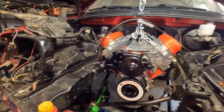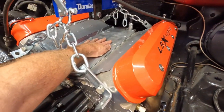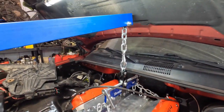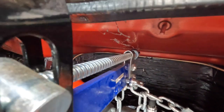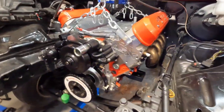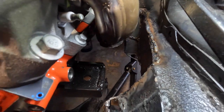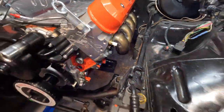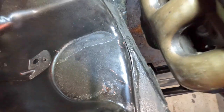We've made some progress. Here's the motor sitting in there — it's just floating for now. Got to get a different way to suspend the motor. I do have a plate; I was just up at work to grab it but grabbed everything else but that. We need a little more clearance with the cherry picker — it's about to hit the hood. Unfortunately, with the engine leveler there, I scratched the crap out of the upper part of the cowl, so I'm not very pleased with that. But here's the biggest thing: we have boatloads of clearance for these manifolds. The lower flange portions are not welded onto the manifolds yet, so we've got to get to that point. Tons and tons of room — I probably didn't even have to cut the flanges off these manifolds now that I know that. But I cut them off to try to fit them before we cut the frame rails up.